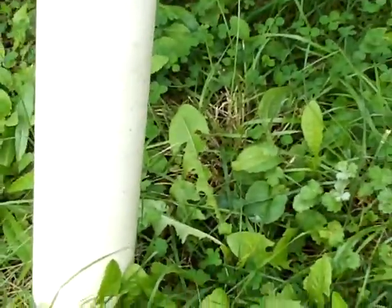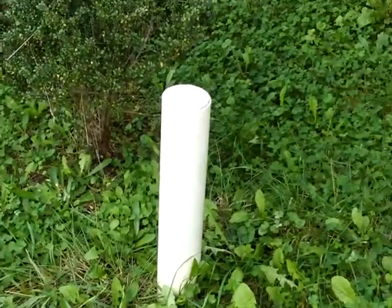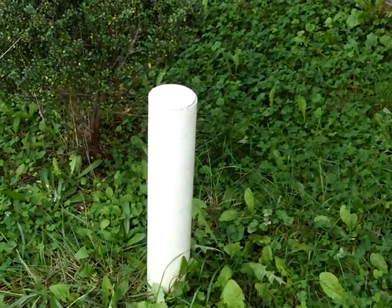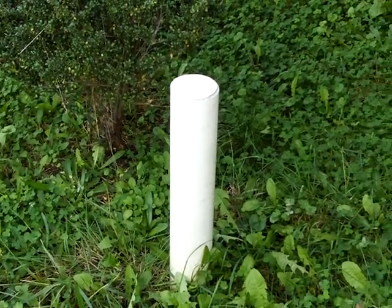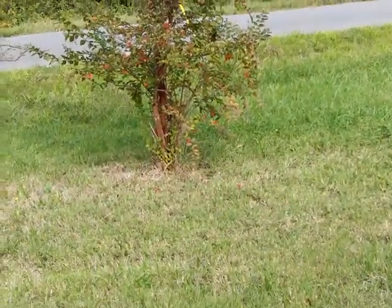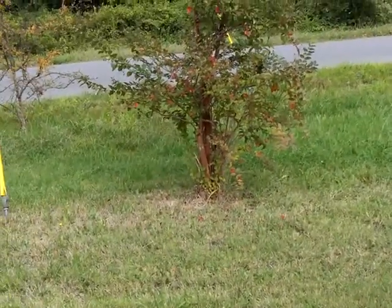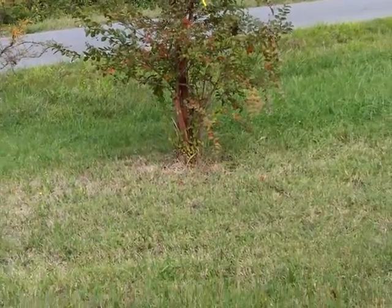Another thing about this house, while we're here, they need to trim the clean out. There's a sewer clean out that's sticking up in the ground there that needs to be cleaned out. I'm not sure if that thing makes a straight line out there, but if so, there's also some trees straight in line with it. I'm not an expert on trees, but you want to think about the root system as that tree matures, if there's a sewer line running under that.